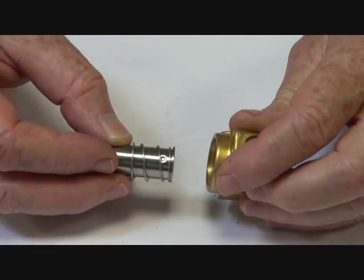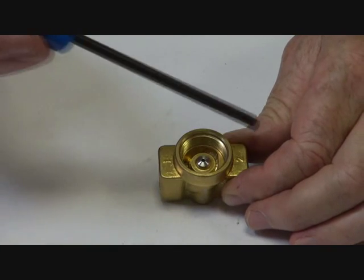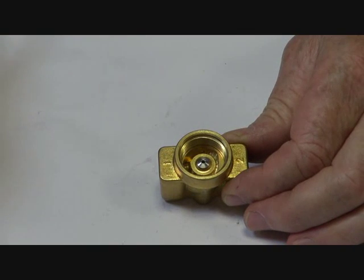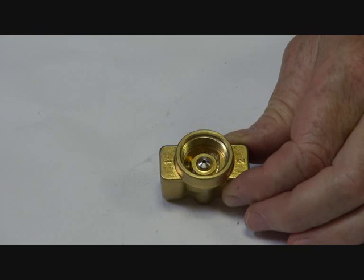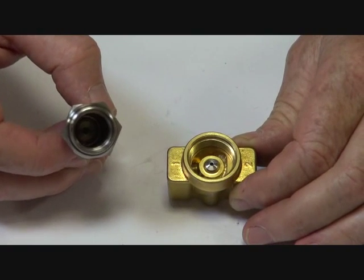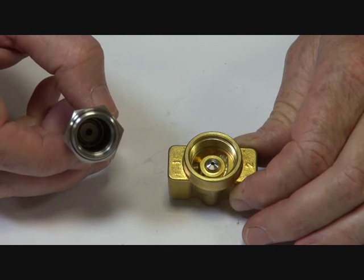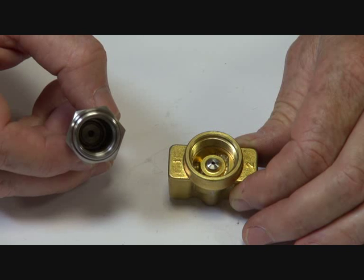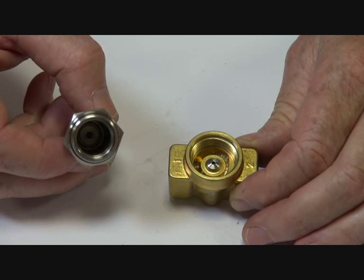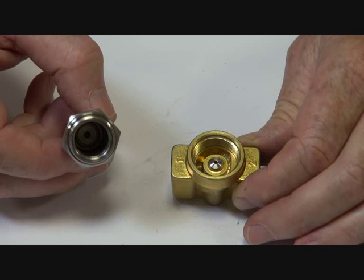Power open — it pulls open and the media then flows down through the stainless steel jet. The valve has stainless steel trim throughout. It's a direct acting valve, so it'll operate down to no pressure. Being direct acting, it's very reliable, rated up to 150 bar pressure range. The size is BSP and the orifice ranges from 0.8 to 5 millimeter.